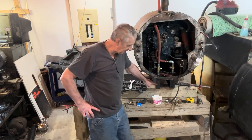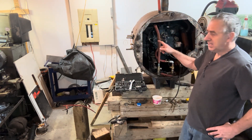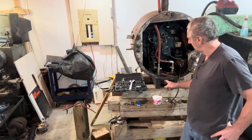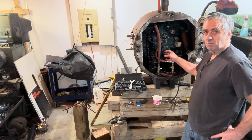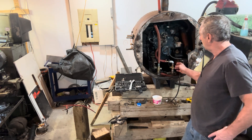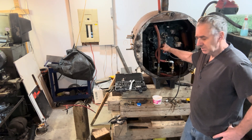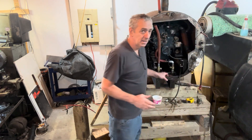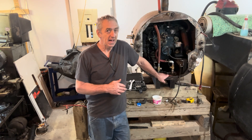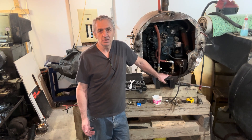You can see it right here and right here. The coolant leaves the engine, comes down this line, through this valve, into this side of the box cooler. The box cooler goes to the back and then there's a pipe going across to this side. The coolant comes back, through this valve, and right into the bottom of the water pump. It can't be more reliable than that — I don't have to worry about a pump failing, and this just uses the engine circulation pump.